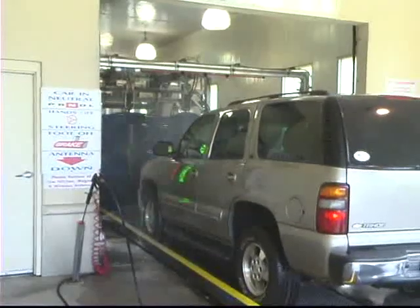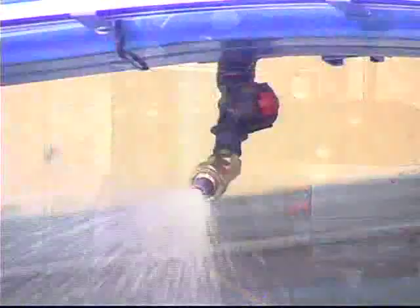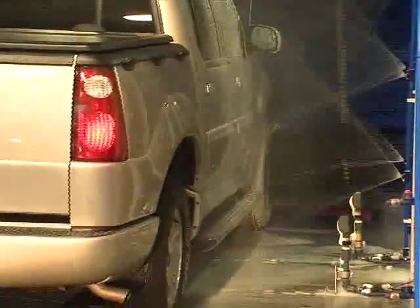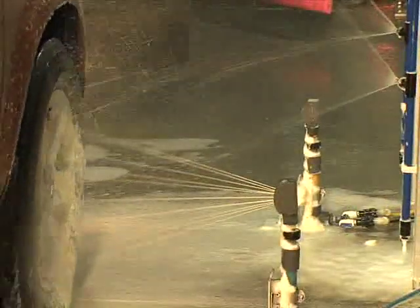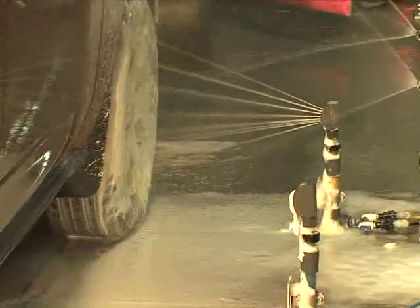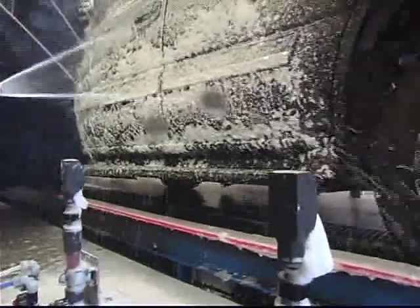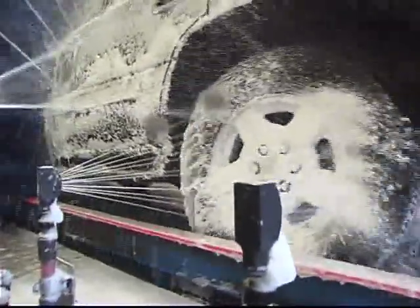Let's go take a look at the hybrid wash process, step by step from start to finish, both in the tunnel and in the back room to follow the support equipment. Upon entering the wash, the first thing to touch the car is a wet, foamed, alkaline detergent. The combination of arches and floor-mounted applicators required will vary depending on conveyor speed. Simultaneously, wheels and tires will receive an application of non-acidic cleaner — a wet foam detergent applied via two floor-mounted CTA applicators per side, spaced 40 inches apart. Next, a second application of a foamed, low pH lubricating soap is applied immediately before the first friction wash component, commonly a mitter or wraparound washer, with the foaming applicator often attached to the entrance of the wash unit. Lubrication of the wash material is vital. If your low pH detergent does not include a lubricant, then you must apply one separately.